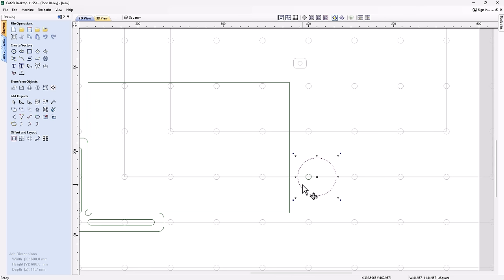And now let's have a look at this. If I hold down my shift key and grab that smaller circle, click the center, and move my rotation point to the center of that circle, then when I grab this outside circle, you'll see what happens is it gets close to my board. And then let's just say I add a little extra force to tighten it on there, then tighten down the bolt in the middle and let go. I can accommodate all kinds of different pieces or sizes of wood.